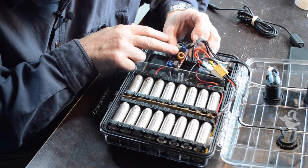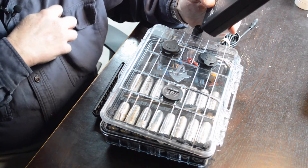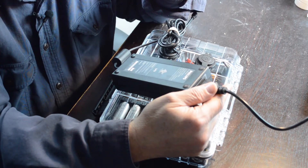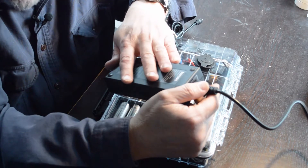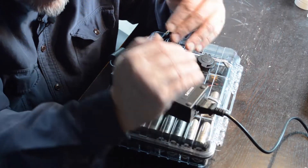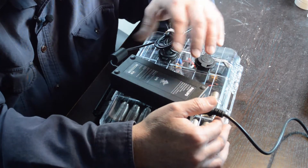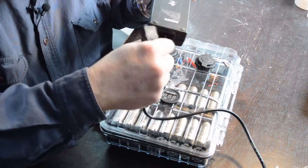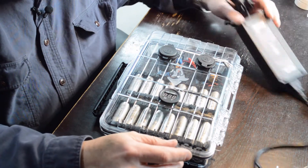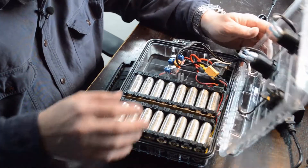What I use to control charging is this little lithium-ion charge controller, which does constant current / constant voltage and lets me adjust the battery cutoff — because I don't want to fill these too full. For the charger itself, I found this at a thrift store for a buck. It's a Philips charger — may have been for a laptop — and it outputs 16 volts. Even without the controller I could charge these batteries with it, but the problem is it would keep pushing juice in when it needs to cut off. You can't trickle charge lithium-ion like a lead acid battery.